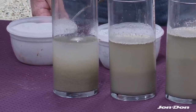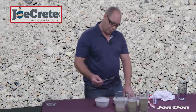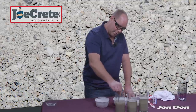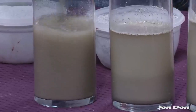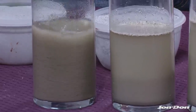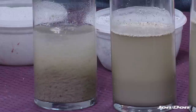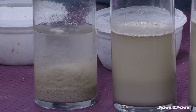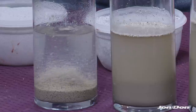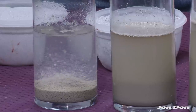As you stir this up, make sure you have good agitation. As we let it run, you'll see that it's instantly grabbing the cement solids and precipitating them to the bottom. As this moves more and more, you'll see it start to swell and get bigger. Another round of agitation will increase the flocculation size, grabbing more and more of the solids and providing clear water at the top. This is demonstrating the light polish — about 800 grit to 1500 grit wet polish — the type of water you'd have left over.